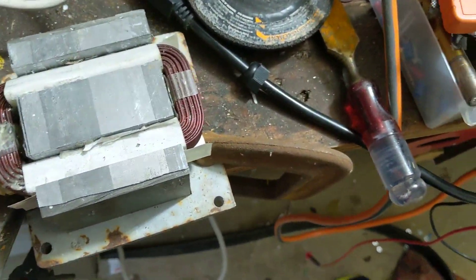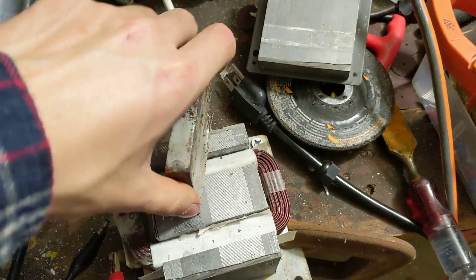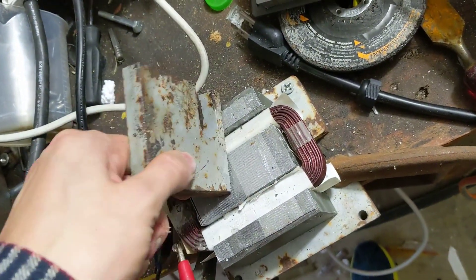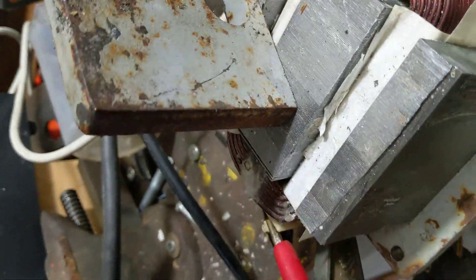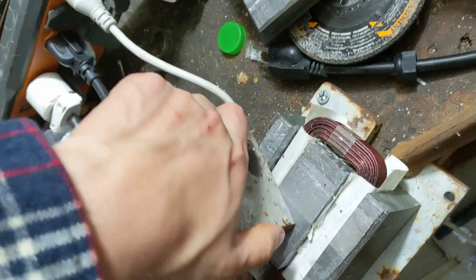The flux is proportional to the area. If you put a thin piece of metal on, these smaller things you can pull off — they don't stick that well. That's expected. You can kind of remove smaller pieces with torque, but you can't yank it perpendicularly — it's not possible. When you apply torque it creates an air gap, and once you give it a little torque the magnetic field gets really weak, because when you have an air gap the magnetic field can't travel through air well — air is not permeable to the field, so it becomes weak. That's why you can slide or rotate things off, but you can never pull this vertically. It's impossible. This is good for a lifting magnet or similar use.